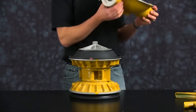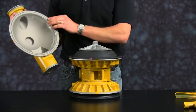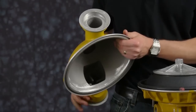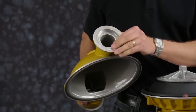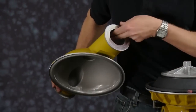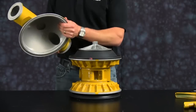Now we are ready to install our outer chamber. Inspect the outer chamber for casting integrity. Inspect the machine surfaces and radius of the chamber for damage or material buildup. Scarring, scratching, or material buildup can be cleaned up using emery paper, crocus cloth, or fine sandpaper. Ensure the radius on the inside of the chamber is maintained during cleanup.